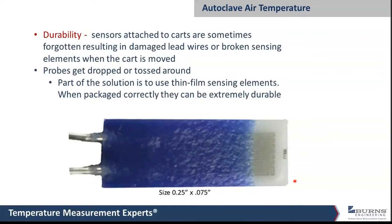When the sensing element is packaged correctly and the leads are supported so they can't move — no relative movement between the lead and the glass material covering the platinum traces — they can be extremely durable. With this correctly packaged probe, you can actually bang it on the floor and it's not going to be damaged. This is all on the inside of the probe, and you cannot tell just by looking at the outside whether it can handle that kind of abuse or not — the internal design has to be set up this way.